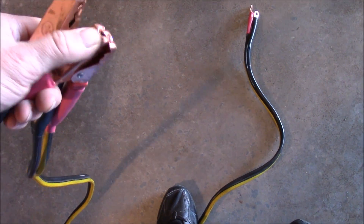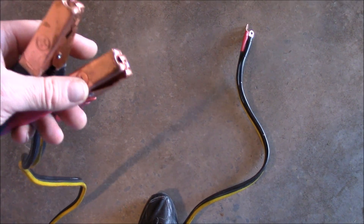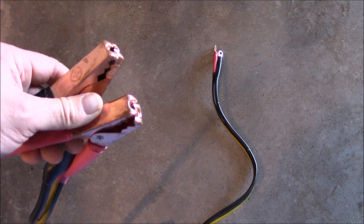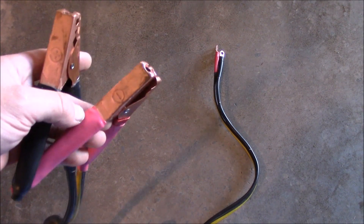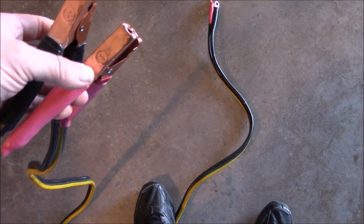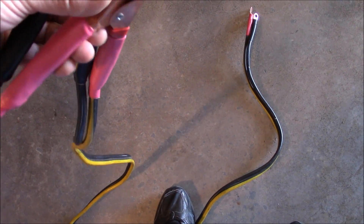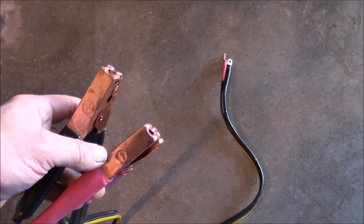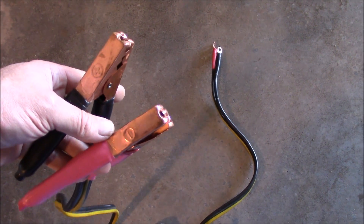However, these were very warm when I pulled them up. I don't know if it was the heat of the engine or what, but I'm not really impressed. This will probably run full power real good, but I wouldn't do it for a long time. I'm not really impressed with the twin 12-volt power socket idea. Running directly to the battery is better than that, but I don't think this cable is really that good. This jumper cable — it's probably about 4 gauge — but I don't think these clamps are making good contact on the battery, causing a little bit of heat. Without screwing up my truck and charging system and blasting fuses all over the garage, I am not going to go any higher than 380 watts on this setup without doing a direct wire.